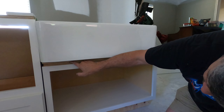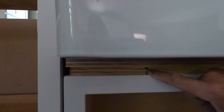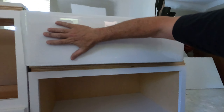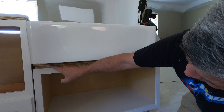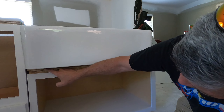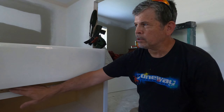See how it lines up right here — we'll show you a little more detail when we flip this over. Then we cut two pieces of three-quarter-inch plywood right here, and we're basically going to build a spacer to get the farm sink at the right height. One of these is going to be the bottom of our spacer and the other one's going to be the top.